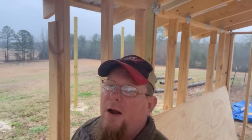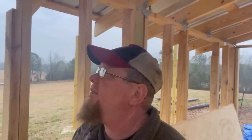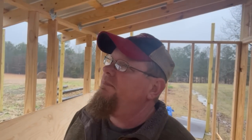Let's talk about the roof. I still got one header to build, but what we're talking about is right up here — guys, I didn't put a second top plate on. I was in such a hurry racing the rain, trying to get what I could get done between rainstorms. I got the walls stood up and tied together and just started throwing rafters up and totally forgot to run my second top plate. I thought about leaving it, but we get a lot of wind here and I'm worried it'll cause problems — bowing and settling, especially with a rafter right in the middle of a doorway opening. If I'd done it right the first time it would have cost me an additional 15 minutes. Now I'm going to spend a couple of hours fixing it.